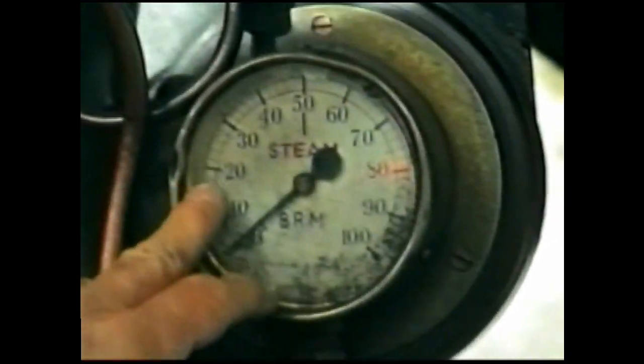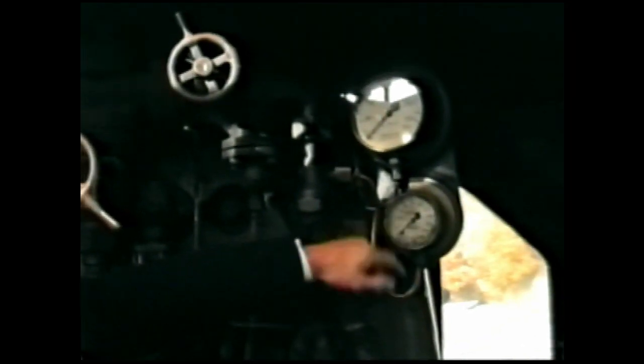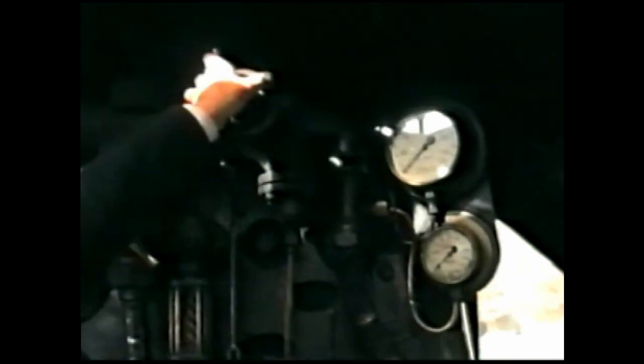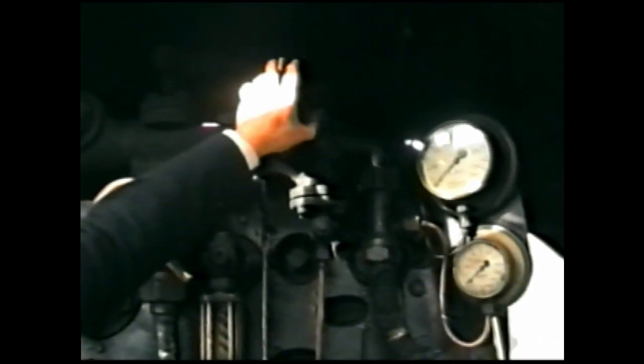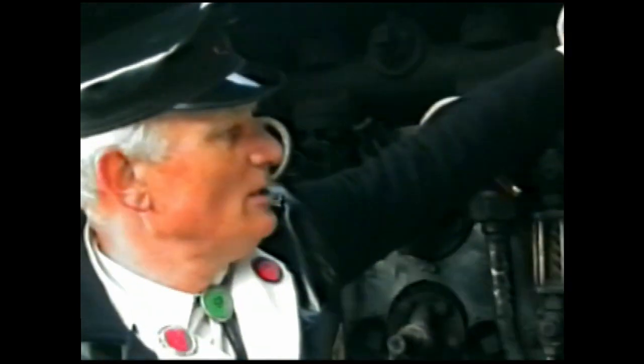If we move away from the damper and come to the first dial, we see that this is the steam heat gauge dial. It tells us the pressure in pounds of the steam that is put through the coaches, generally up to a maximum of approximately 50 pounds for an eight-coach train. It is operated by the steam heat valve spindle. We would open the steam heat valve until we got the appropriate poundage pressure of steam required for the number of coaches in the train, and would shut it off probably about a quarter of a mile to a mile before the locomotive reached the end of its journey, so that when we came to disconnect it there would be no pressure going through the pipe at the front or rear of the locomotive.